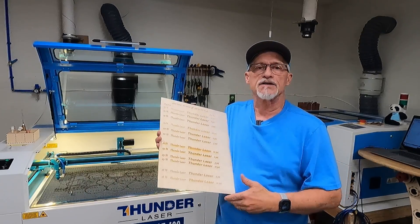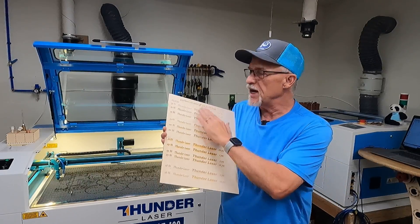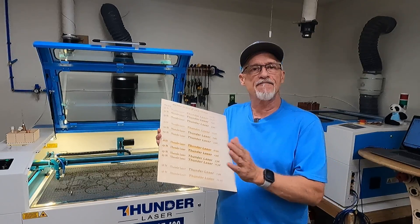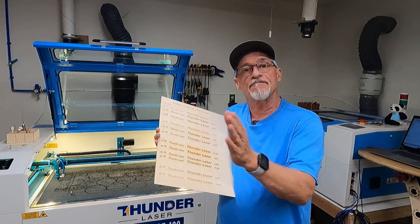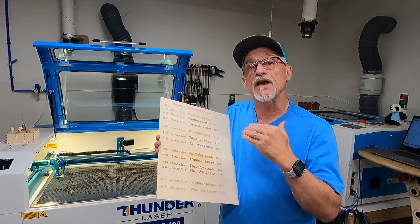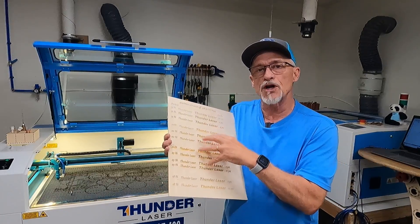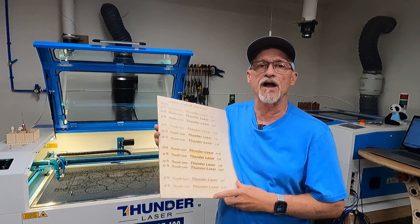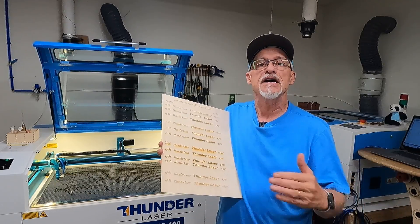I'm going to show you some examples of what I've got on this board. What I've done today is I've kept the speed the same — we're going to do all of our process today at 400 millimeters per second. Most of my favorite engraving speed ranges anywhere from 350 to 500 millimeters per second. From there, I adjust the power up or down and also the airflow up or down. You're going to see today that airflow, especially on wood and acrylic, will have a huge influence on how much contamination you get on your engraving and how much work you're going to have to spend after you pull it off the laser to clean it up.